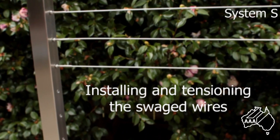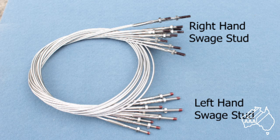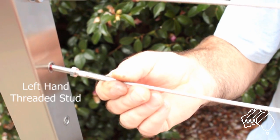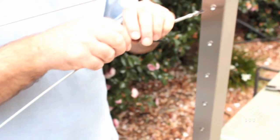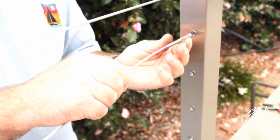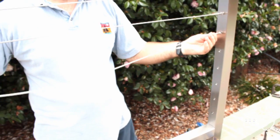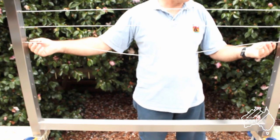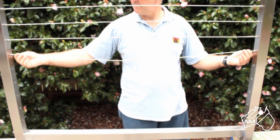You are now ready to install your wires into the blind rivet nut inserts. Taking the wires with a left-hand threaded stud swaged on one end and a right-hand threaded stud swaged on the other, it is a simple process to screw the left-hand stud into the left-hand nut insert — just a few turns to get it started — and the right-hand stud into the right-hand nut insert. Continue rotating the wire until it is tensioned. It only needs to be firm and not sagging, not piano wire tight. Be careful not to over-tighten the wire as you can exert a tremendous amount of force on your posts if you try to make the wire too tight.